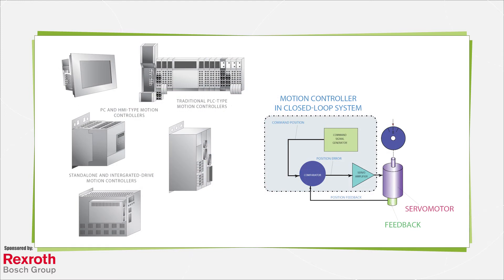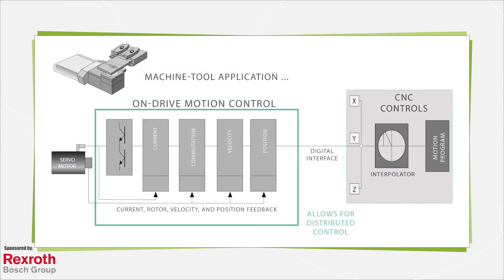When integrated into a piece of machinery, motion controllers trigger axes to follow set points in either open-loop, as with most stepper motor designs, or closed-loop, with the help of feedback. Then those signals go to the axis drive to ultimately prompt the actuator into action. It's increasingly common for motion controllers pairing with electric motors to take the form of what industry calls smart drives — units that include both control electronics and circuitry to supply electrical power to the motor.